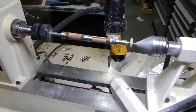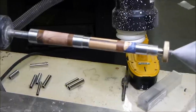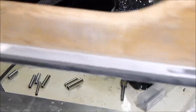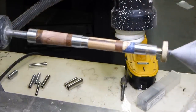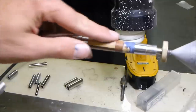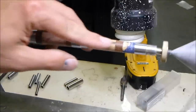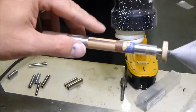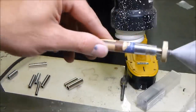The ends where the woods meet are critical: the wood has to come to the exact outside diameter of the bushing. Wood is harder and softer in different spots and sands at different rates — that's the challenge if you're OCD like me. I try to take the wood just a hair below the bushings because the CA finish builds up. I take a piece of sandpaper, roll it, and wiggle it so the end catches the metal bushing to level it perfectly.